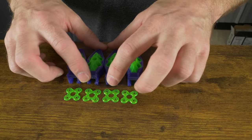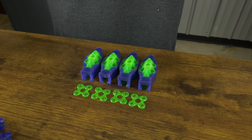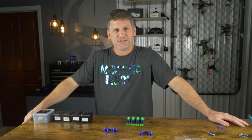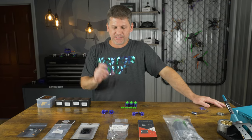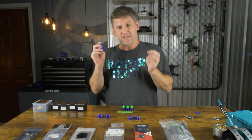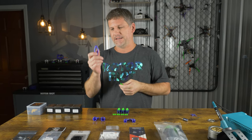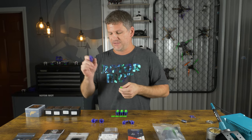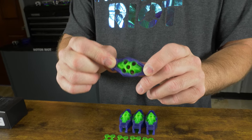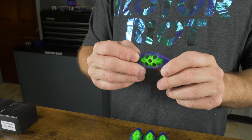This is a new design I've been working on with Julian from Nuzel3D. He came up with a really amazing idea to make a hybrid arm protector that has PETG inserts inside of a TPU arm protector. We have hard PETG material and soft TPU material — the PETG protects the arm from impact and the TPU allows you to skid along the ground. They're not attached to the arm with screws, so you can still access all your motor screws without removing the arm to change motors.